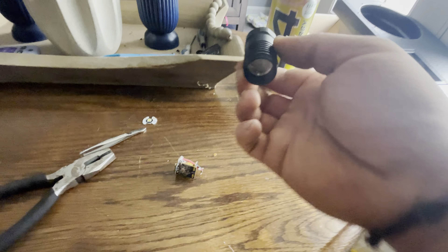When you look at it, the head of the screw comes off. There's glue, so you're going to have to work hard to get that off. There's a little screw right there on the left side — you can see right through. It's a little Phillips; you just take that out. And then there's two wires, of course, on this side — positive, negative. You will need to desolder it. If you don't know how to do it, I suggest not doing this.